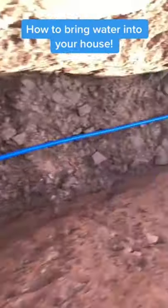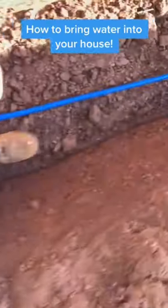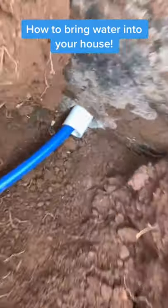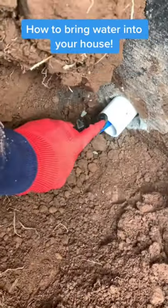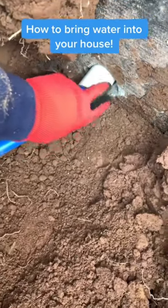If you look here, I just put that PEX right into the ditch, and where I took it into the house, all I did — let me show you real quick — I just put a inch and a half piece of pipe and fished it through, so that way it isn't up against these rough edges of the block where I busted it out.